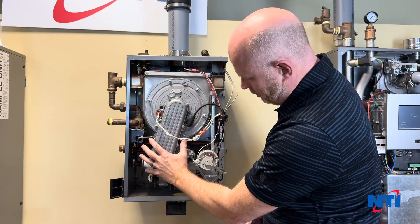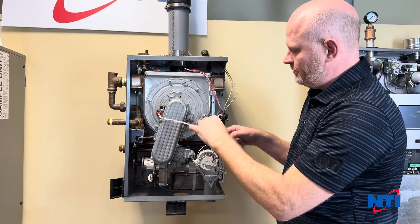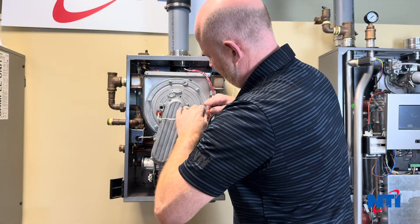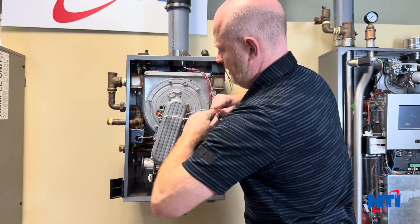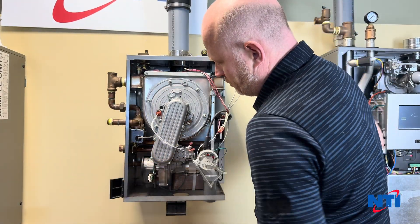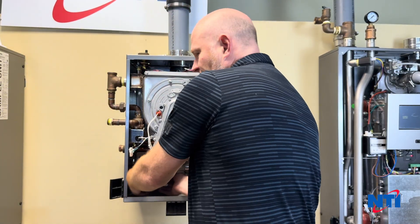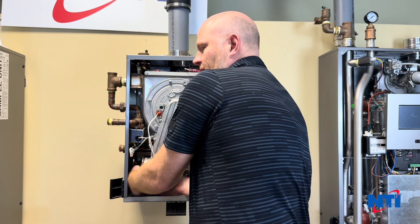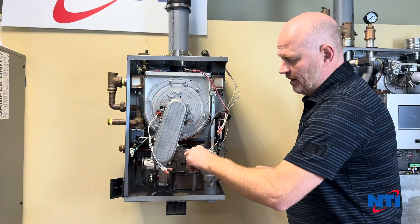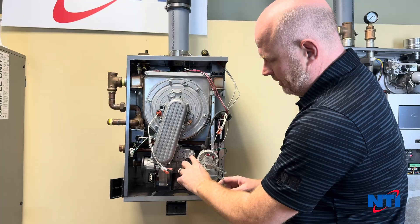Once you have your gas line out of the way, we're going to take off the burner door, blower motor, and gas valve all as one assembly. We'll start by removing our wires — there's the flame rod wire, and we've got our hot surface igniter. Get these connectors apart; it's a good idea to have pliers as those can be quite tight, especially if they haven't come apart very often. Push them to one side. There are two harnesses on your combustion fan motor: a 120-volt and, in the back, a low-voltage wire harness.